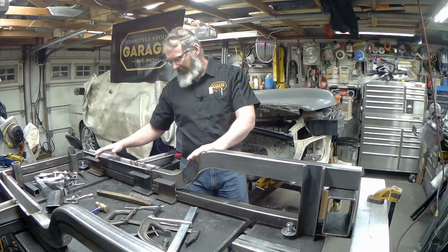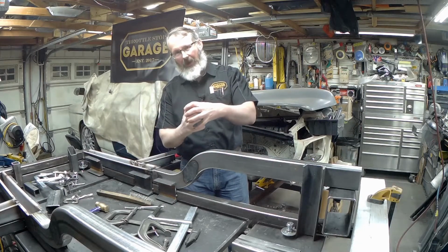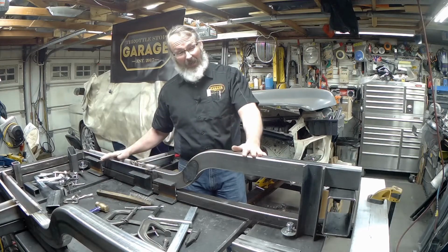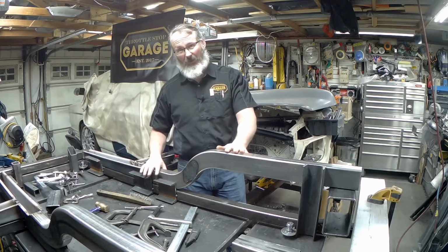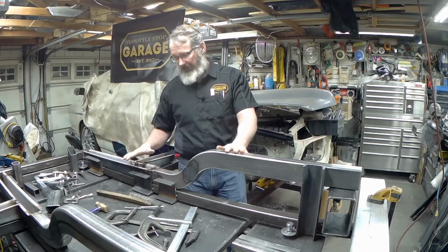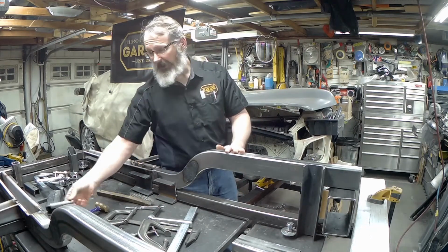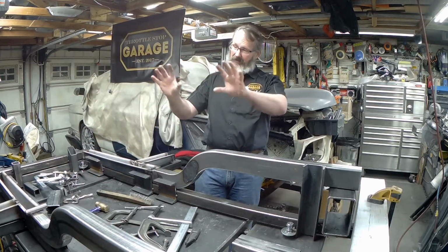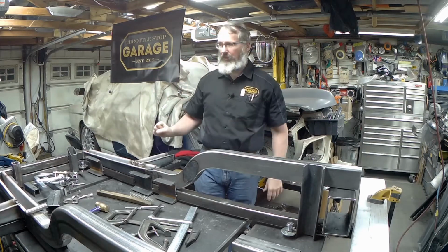So when I welded them, again, remember we talked about that before, whenever we heat metal, it's going to contract. So try as I might, you saw how I had it clamped up here. It didn't matter. There's tensions that are going to develop within the metal. So while they're still hot, all I was doing there, on the other side, I actually did have to resort to putting a little bushing underneath. And the metal's still warm, still sort of malleable a little bit, and I'm just giving it a little bit of a cold relax there.